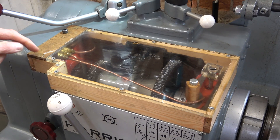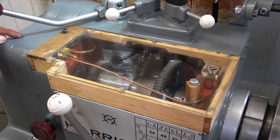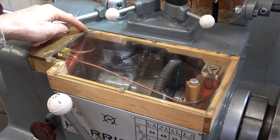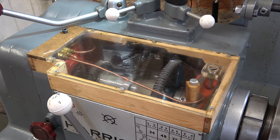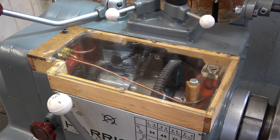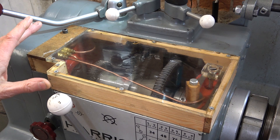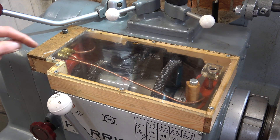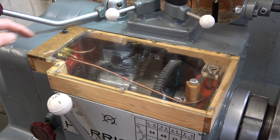My homemade manifold has three pipes coming off it: one to feed the front spindle bearing, the middle one to feed the back spindle bearing, and one going off there to feed the bearing on the end of the power input shaft. The current pump has quite a high flow rate. I didn't balance the output from these three pipes, so if I'm using the peristaltic pump with a very low flow rate, it's possible I get flow on the back pipe but nothing on the front pipes. I'll need to get this lid off, set it up with the existing pump, and check for equal flows — I may need to crimp the ends of the pipes to balance the flow across all three.